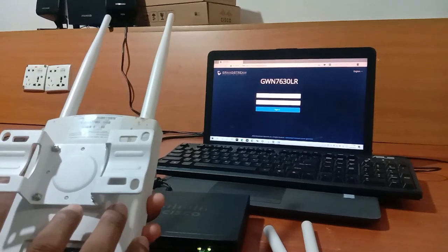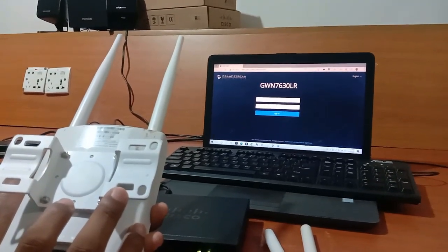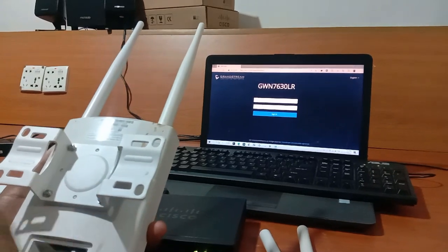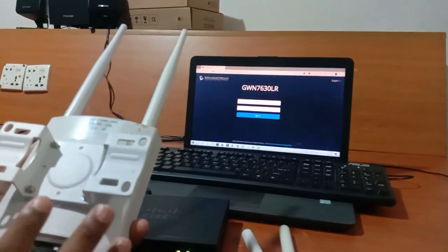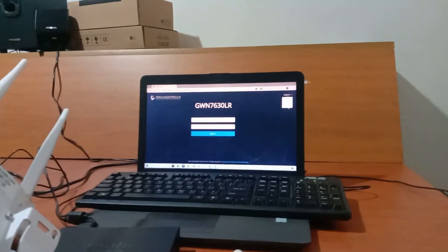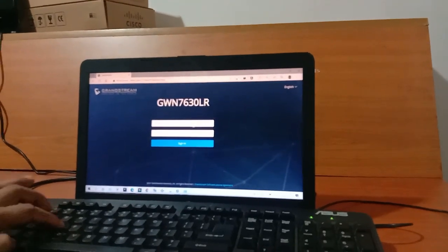If you unnecessarily try to log in to your device repeatedly, after 5 login failures it will be automatically locked for 15 minutes. This is a very important point when you configure this device. You should remember that you can try to log in a maximum of 4 times. After 5 failures, it will be locked for 15 minutes. Another thing you can see here is the language selection. You can select Simplified Chinese or English. Here I will type admin,